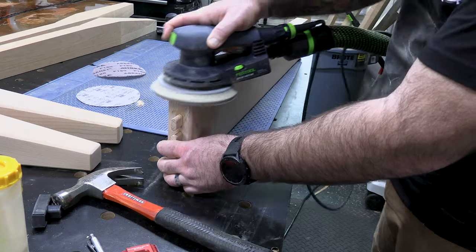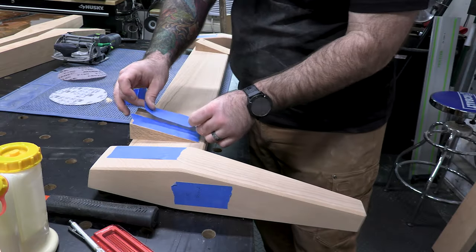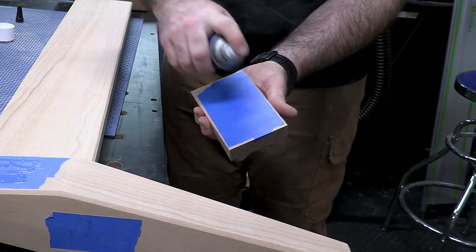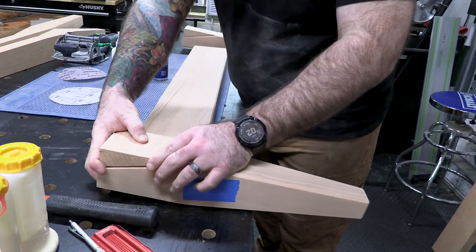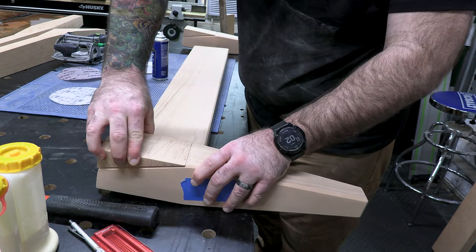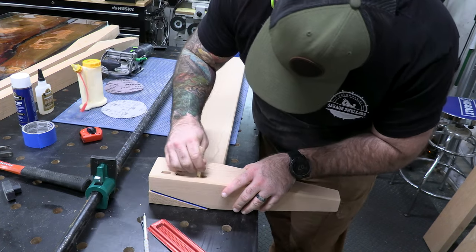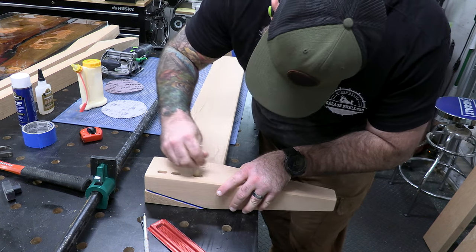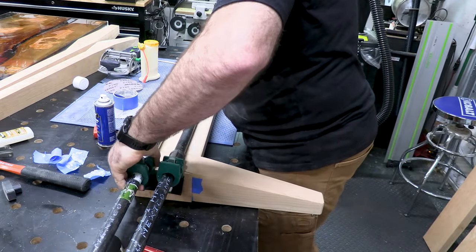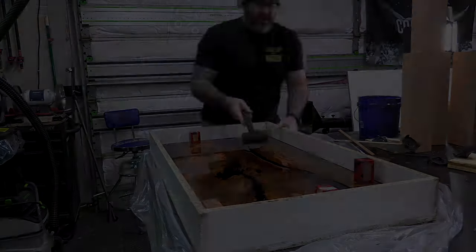I had to use a bunch of dominoes for this project — the stretcher at the foot and another at the head each required six dominoes. Being able to clean them up in batch was really nice. It's also really important: don't throw your scraps away until the project is done. The outside taper on the feet made it almost impossible to clamp, so I used CA glue and masking tape to make clamping cauls from my offcuts — I use this process a lot with angled furniture and it always works really well.